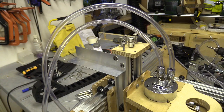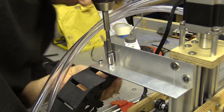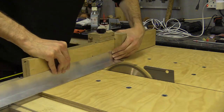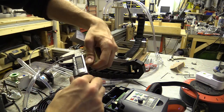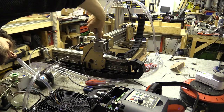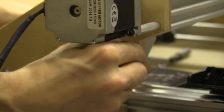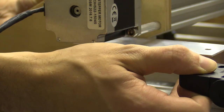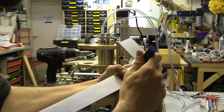It would have been nice to make these using a 3D printer, but I don't have one — I have a table saw instead. I want to fit as many of the brackets on pre-existing fixings, saving myself from having to make changes to the plates. The 90 degree angle brackets I placed under the X axis aluminium extrusion find an additional use here. I have to double up this section to hold the two ends of the X and Y drag chain, securing with locking nuts and M5 dome machine screws.